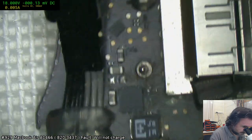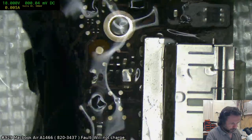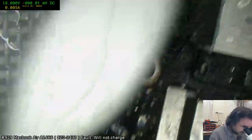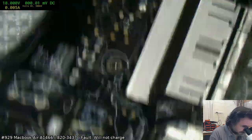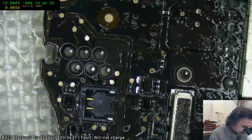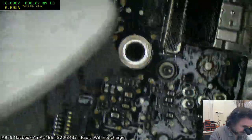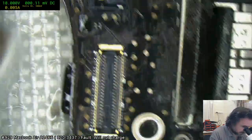Green pad, top left area. Yeah, I think I was looking at that. You're talking about on the 6-pin chip. I really should put effort into making a board view for this one. Maybe a schematic. Well, not reverse engineer, but I should be able to deduce most of the parts on this, because a lot of it is actually just a replication of existing circuitry. Like, if you take a 3115 board or something like that, the circuitry should be similar.